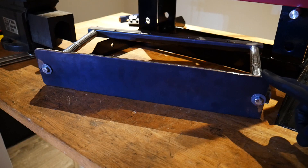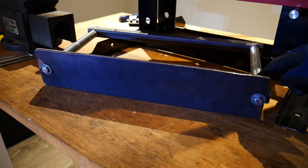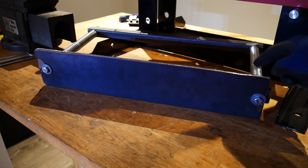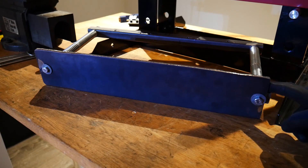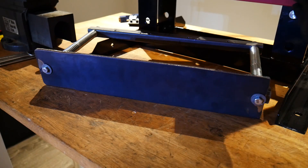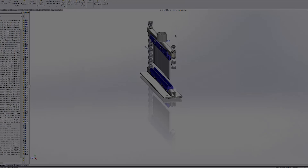Looking at the bottom of the plate, there are two fasteners — I'm using metric M8 bolts — that gave me enough wall thickness in my guide rods, which are five-eighths inch in diameter. They're basically just bolted into the bottom of the guide bars, so I had to center drill those ends. The bolts go into the bottom of the guide rods, and the guide rods go through that square tubing, sandwiching everything together and holding those guide rods perpendicular to the plate. That perpendicularity is very important so that your top bar can slide freely and return to the top with the force of the springs.